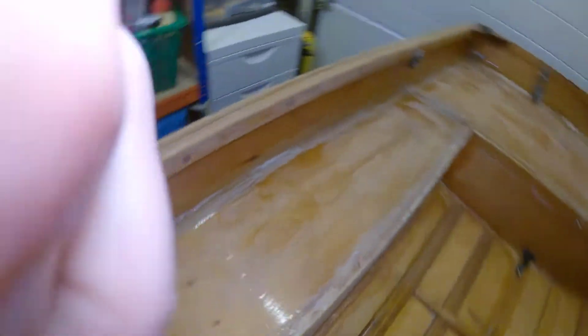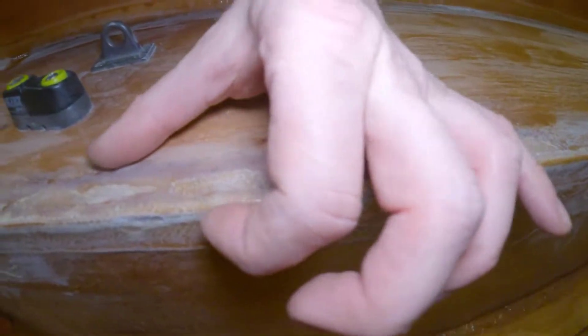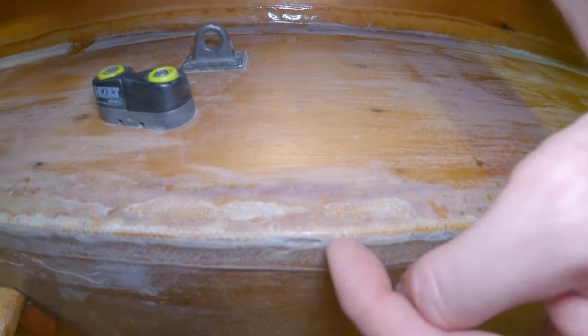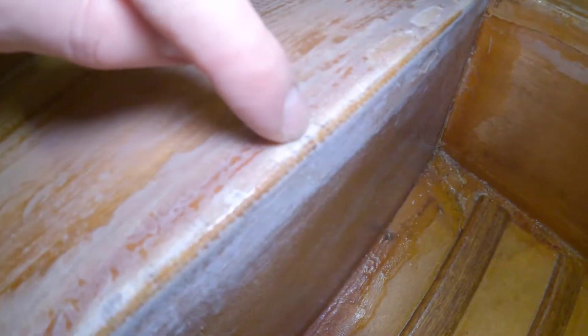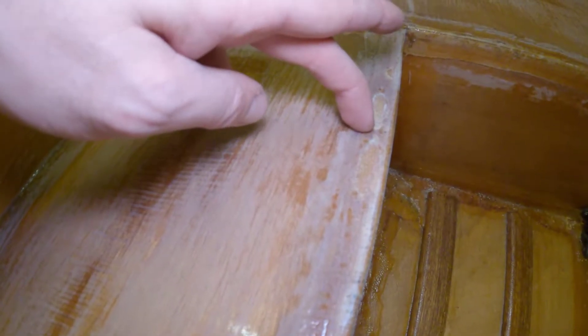The other thing we can do is where the epoxy is coming off — I've decided to leave that there and start injecting epoxy down there. That job will have to wait till tomorrow. You can also see these little holes in the tape where the epoxy has run out. The third job is here where the varnish has rubbed completely off and gone right back to the epoxy — we may as well fill those with epoxy because it's faster drying and harder wearing.